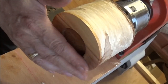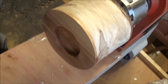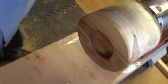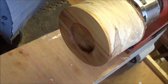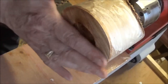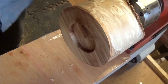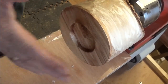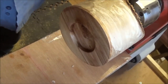When your paper towel is clean, you won't take any more off. And that is a beautifully smooth finish, and I don't think the camera will pick up, there's actually a bit of a shine on it already. But it's now ready to accept whatever polish you choose to use. I won't get into that. I'll probably use some Sheila Shropshire Shine, I think. Or Woodwax 22, whatever, I'm not bothered. Okay, I'm going to get a coat of polish on that now. Then I can turn it round.